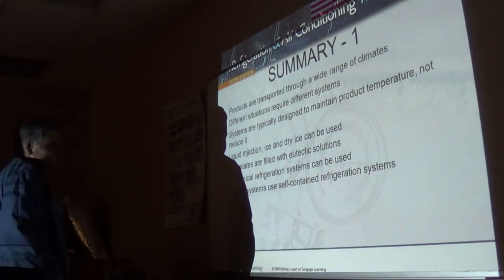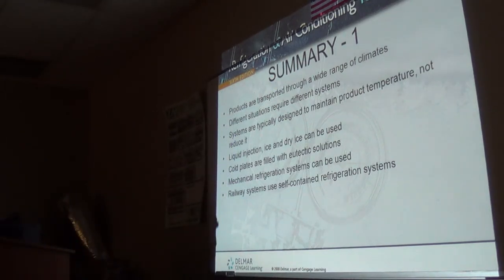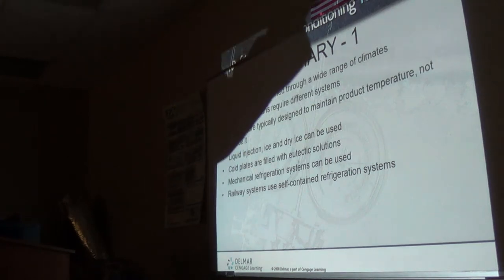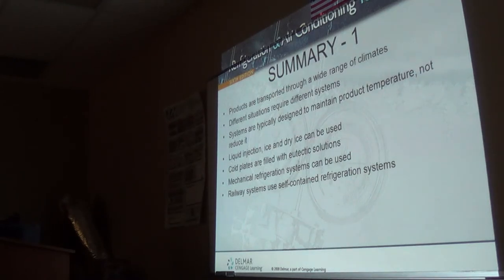Since then, as you get exposed to things out there, you'll notice they have some motors they call TEFC motors, totally enclosed fan cooled. They also design motors they call explosion proof, in that none of the electrical connections are exposed to the atmosphere, because if there's just a little unwanted spark at the wrong time, it's going to explode. That's what we had to do in the Lincoln Tunnel, change everything to explosion proof boxes, explosion proof phones, explosion proof lights.